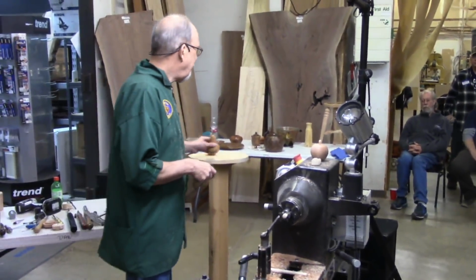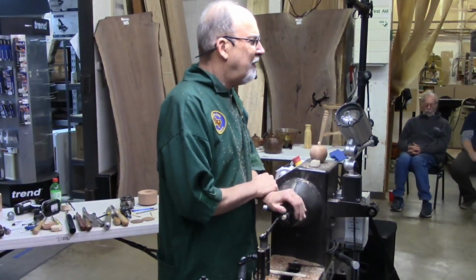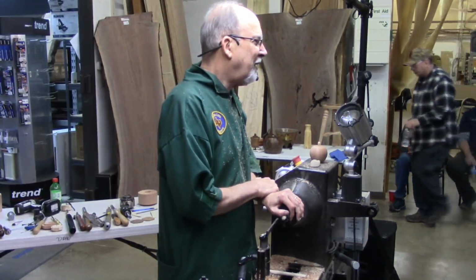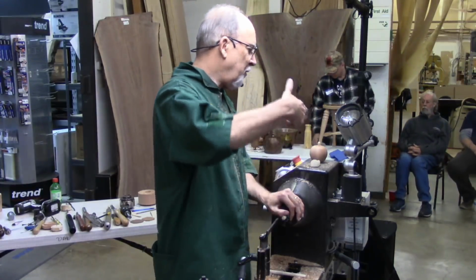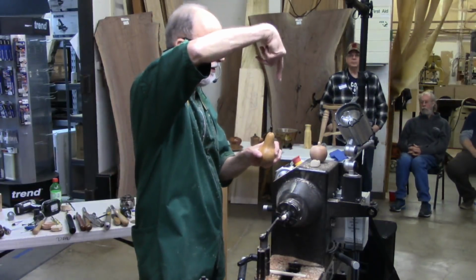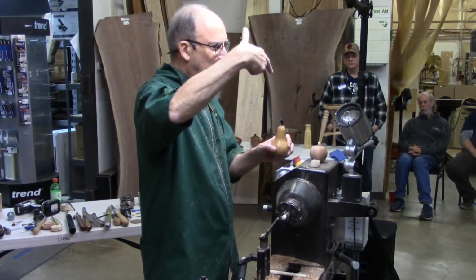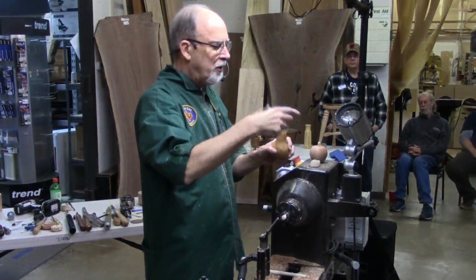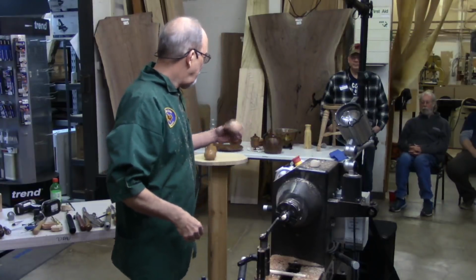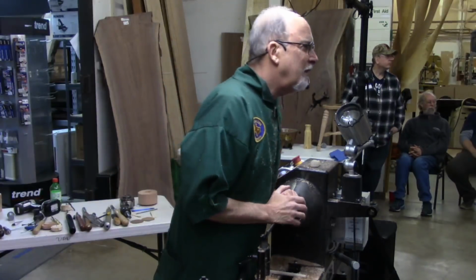Okay. Any other questions? I would turn a little piece of wood to go in there. Just glue it in. And when you're drilling like that, you don't start this way. You start straight up and down, and then you turn. You have to move like this as the drill is going. So you need to practice, or else you end up with an ugly hole. So, anyway, that's it. Any other questions? Yes?